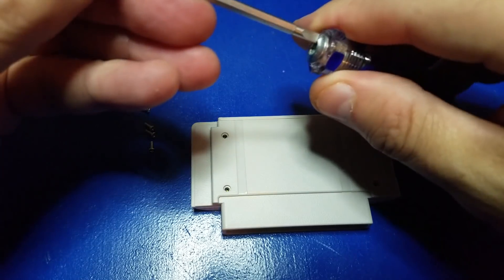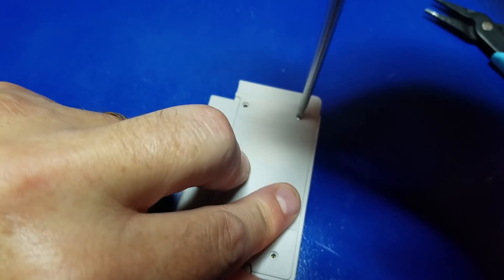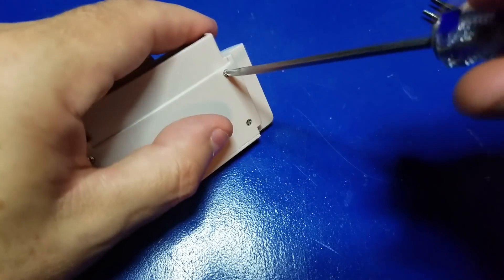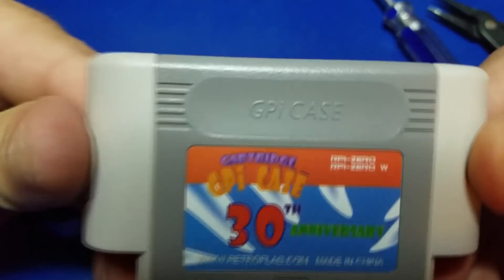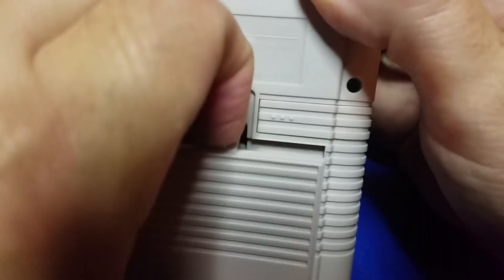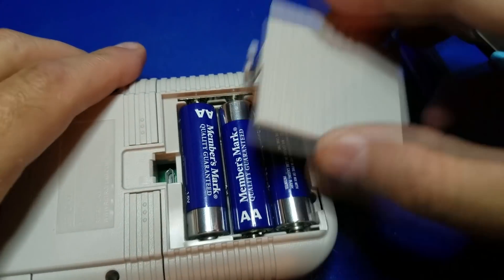So let's go ahead and tighten these small four screws in. We're going to flip the screwdriver around to the Phillips head and tighten these little boogers down. That looks really cool. Let's see how it slides in now that everything's installed. As I mentioned, this little switch here — you want to switch it over to on. That's for your shutdown script, which we will be enabling. So let's go ahead and do that and install these batteries, then put the cover back on.